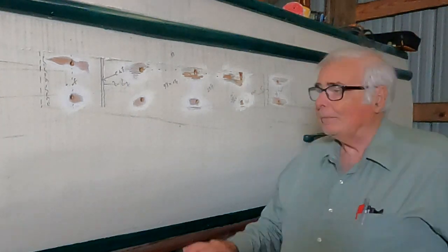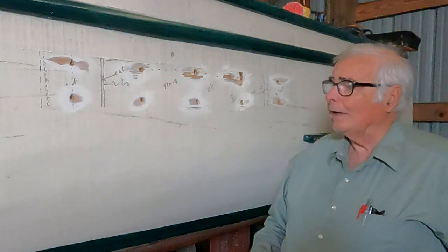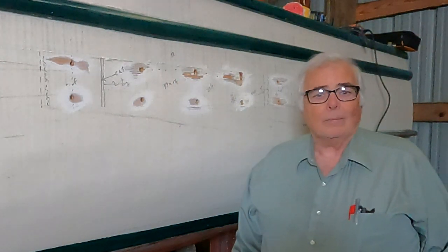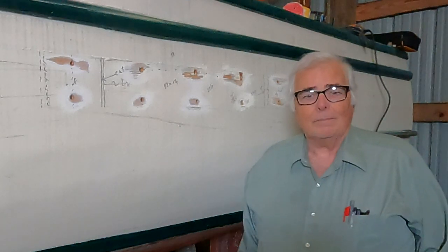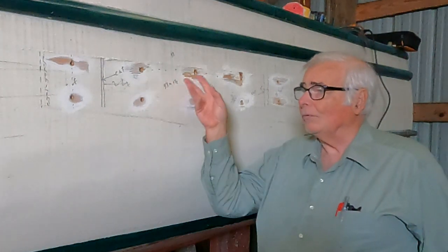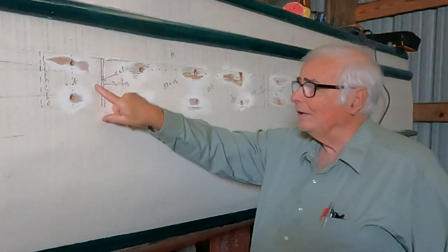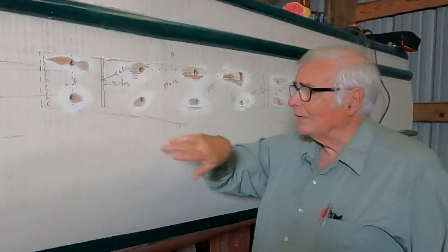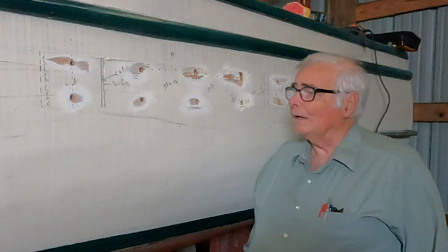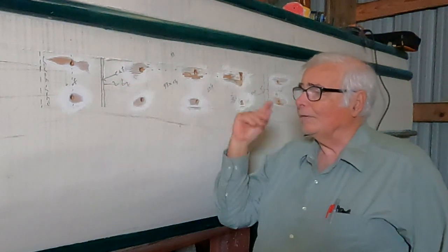Today I'm going to cut out bad wood. Yesterday I went into town and bought some wood to replace this wood, and I also bought some new saw blades for my reciprocating or oscillating saw, because the ones I had were so dull that they simply wouldn't cut this wood. I can see I missed some fasteners in here — I'm going to sand this off, get the last of these fasteners out because this is apparently a butt block here, and then we will make the necessary cuts.